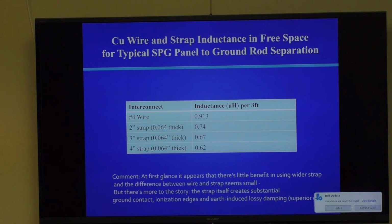And this is the bane of microwave circuit designers, by the way. We run wires, little conductors, flat straps laying on the top of a semiconductor or a dielectric in an integrated circuit. We run those fairly long distances. At microwave, long distances is millimeters. So this is a problem. The fact that inductance is a logarithmic variation on width, you can't improve things rapidly by making it wider. And that's nature telling you you can't have something for nothing.